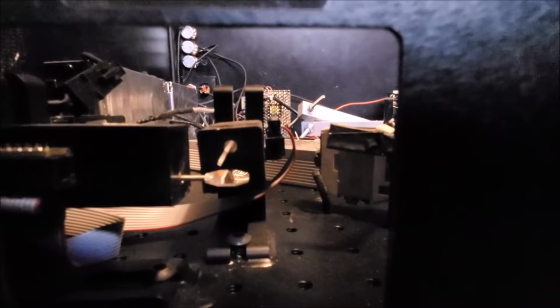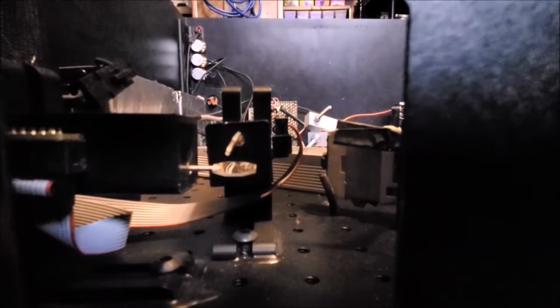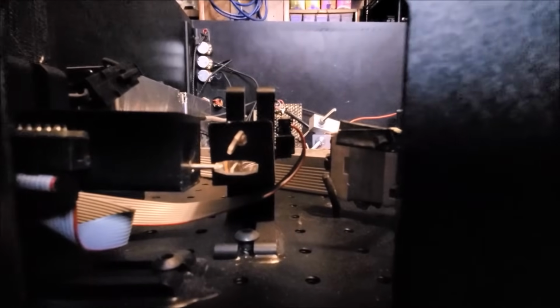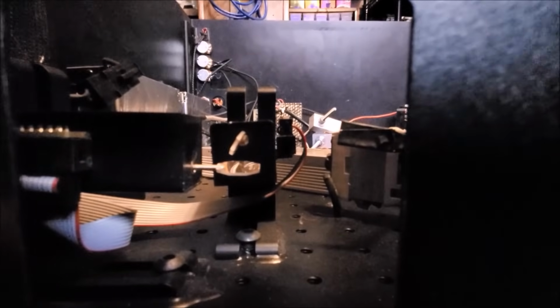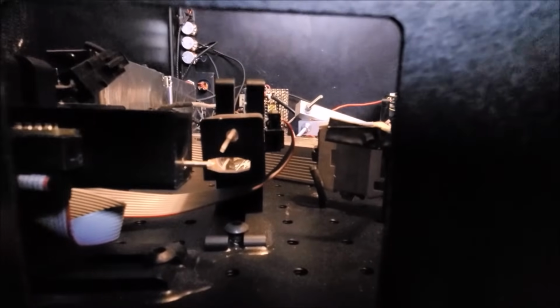They're much bigger mirrors, double the size. So I want to say those are 6 by 12-ish mirrors, millimeters, and we got in some mirrors that are 18 by 12, so much bigger. Unfortunately, it's either going to be slower or a more narrow scan angle, but when you're working with a laser beam that is that powerful, it's also wide, so a little bit of a kpps loss on that, but that's what we have to work with.